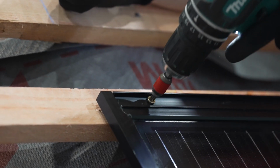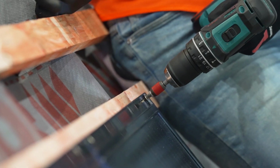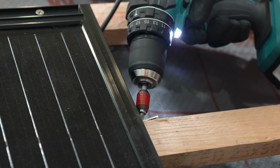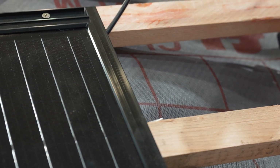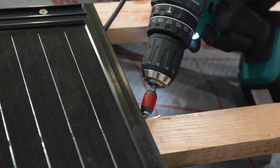Ensure the panel is flush with the other top and bottom and secure using two self-tapping screws. Finish this panel by installing two right-hand brackets top and bottom, the same as previously. Repeat this process for the number of columns in the system until you reach the final column.